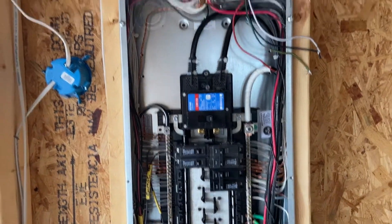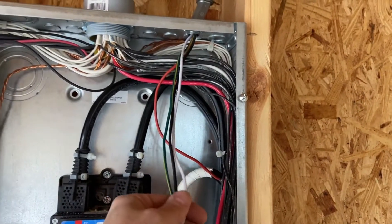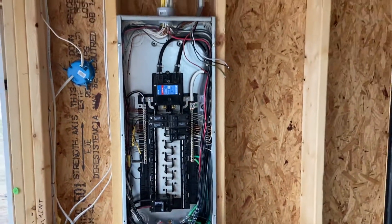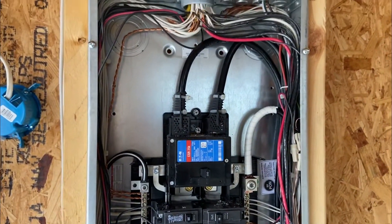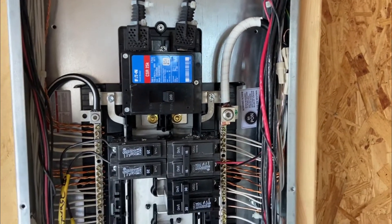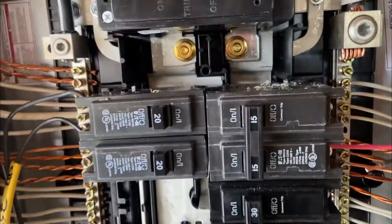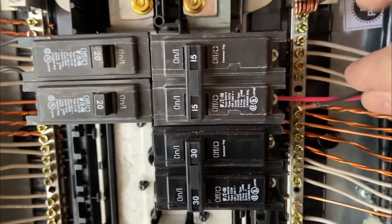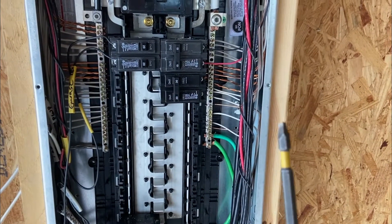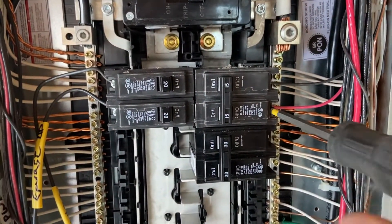All the wires are short — they only come about 12 inches — so we just have to extend them down to the breaker. We've got it in, and we put wire nuts on to extend the wires. We use 14 gauge because you can use 14 gauge up to 15 amps; after that, up to 20 amps you have to use 12 gauge. You can see about how far I strip the wire. I'm using a square tip screwdriver — most breakers come that way now. You can also use a flat blade, but do not use a Phillips screwdriver.